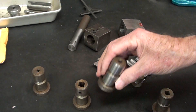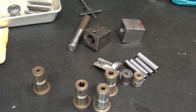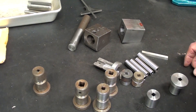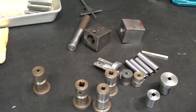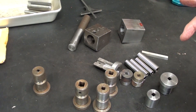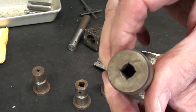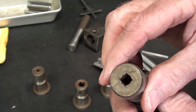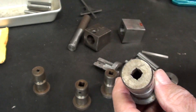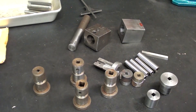How are you going to make a square hole? Raise your hand if you have square broaches at home in four sizes. I didn't see a single hand go up, so let's talk about alternate ways of doing it. Quite some time ago I made a video to show you how to make square holes, and I'm going to show you that video or at least the link to it. These holes on the original sleeves are broached — you can see the little nicks in the corners. But you won't be able to do that, because you would need $600 worth of broaches, and that's not practical.